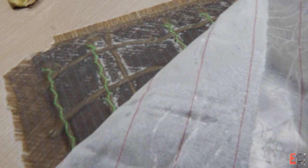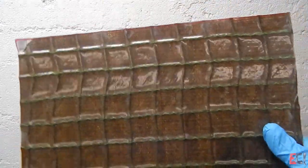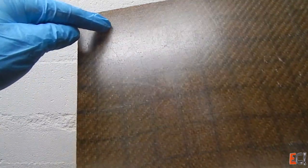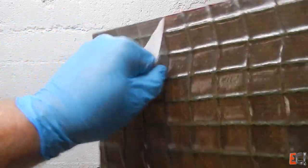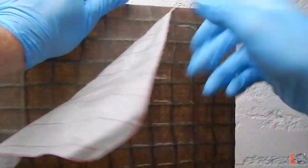There's porosity on the back side. It was definitely nasty when cured — I couldn't make the leak go away by adding extra sealant tape. Fortunately it only crept part of the way into the panel, so I still have a decent sample. Here's a trimmed-up piece, mostly free of the leaky spot, but it's not super shiny — there's some transfer and definitely porosity on the side where the leak was. Don't bag to the Teflon if you have a mold with a Teflon surface, because any cuts or scratches can allow very small leaks.